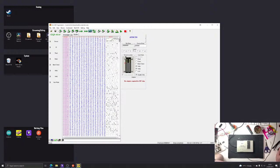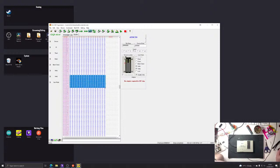Right, so we need to take... There you go. You can see the end of the chip is all double Fs, which means it's blank. What's half of 7FFF? I think it's 4. Yeah, that's basically 8,000, isn't it? Or 80000. So I think if I copy it to there, that would be our new start address. I think that's right.